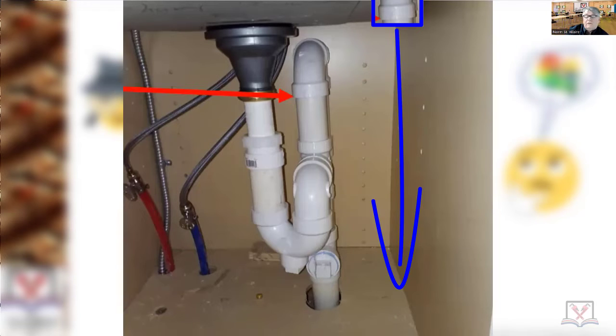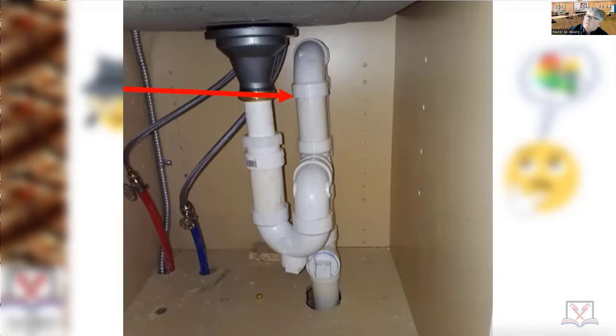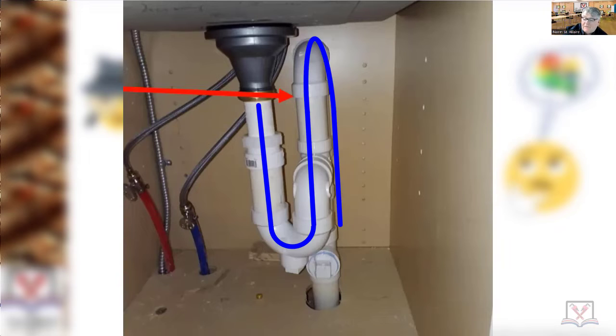This little curve over here should be way up against the countertop of the sink and then coming down. Because right now, if somebody fills up that sink with water — which it's a sink, it has a basket strainer and you could fill it up — water is like water. It seeks its own level as it's going down the drain, so something is going to go up and around.